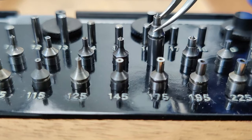Now, before we press the jewel out, we'll apply some lubrication around its edges so that it can slide out smoothly. Positioning the plate between the pusher and the stump here. Now I'm going to slowly lower the pusher. And there, the jewel's pressed out. I was hoping it'd come out in one piece, but it was already cracked, so